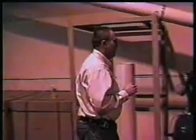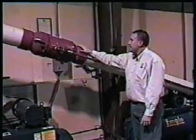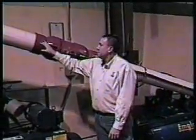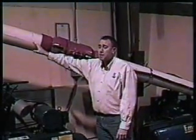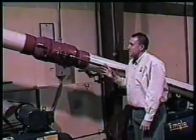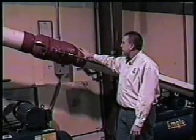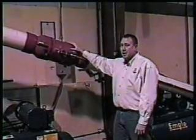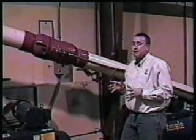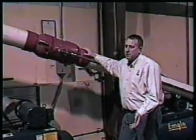Let's take a walk over here and I'll show you an installation that we have in our plant and what we've done to hook one up. As you can see, this is basically set up with couplers on each end that will accept 8-inch Schedule 40 pipe. We recommend that whenever you're mounting this unit, you don't glue the Schedule 40 into the actual Big Shot unit itself. Glue all your other joints and keep everything nice and tight, but we don't recommend gluing it when you're going to put it into the Big Shot.